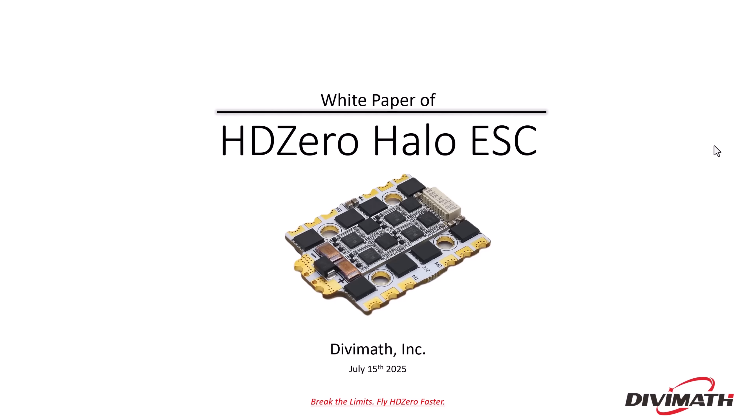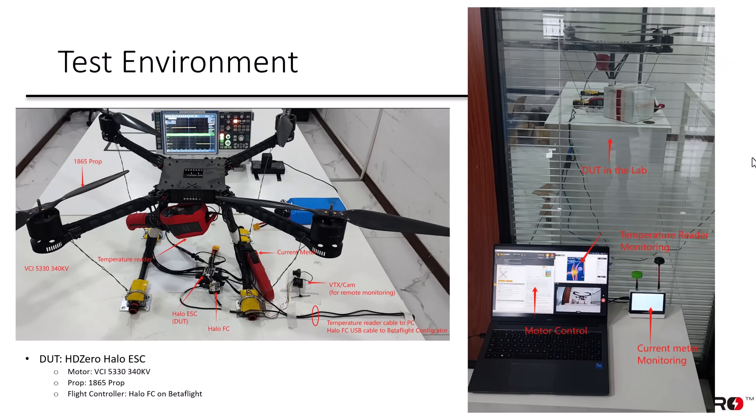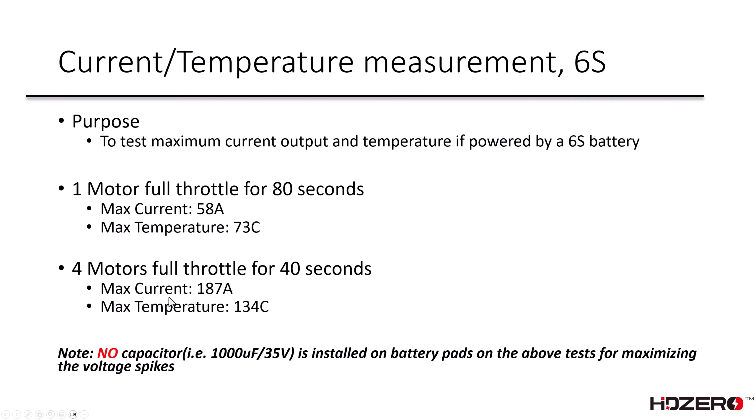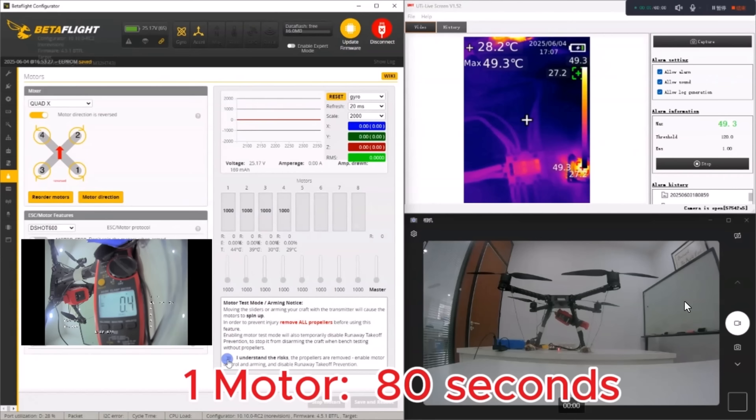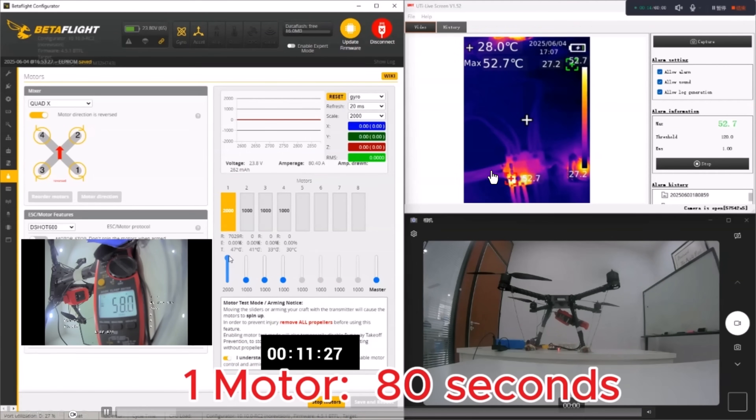That motor dropout could have been caused by unclean power to the microcontrollers, so we made more revisions and improvements to have extremely clean power going to the ESC microcontroller. We've also tested this ESC to the limits — installing exceptionally large motors and running 8S with no capacitor. We've done an incredible amount of lab testing on the Halo ESC. Here is a white paper that we have — I'll link to it in the description. We've tested the Halo ESC with a large 18-inch propeller and 5330 motors, measuring how much current we can pull in different conditions, ramping power up and down rapidly, and measuring temperature throughout.